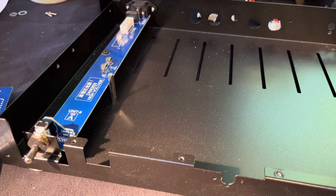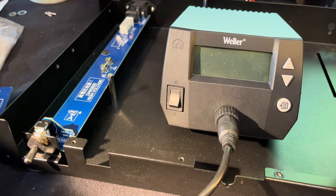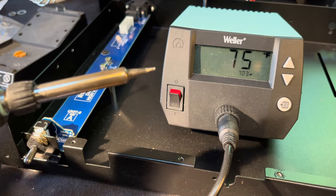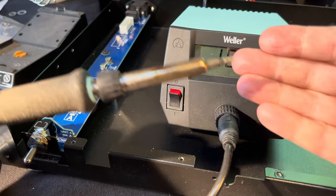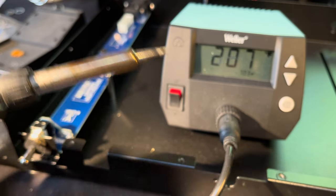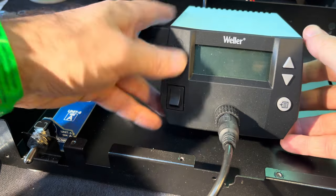That takes a little patience. I don't think this is really a good kit for a beginner builder — if you've never built anything, you're probably going to get frustrated. You also need to know how to solder and solder small things well. I've got this Weller soldering iron — it's digital. It's a pretty small, sort of medium-size point, but it can deliver some power because there are some places where you have to feed a lot of solder to properly put certain things together.